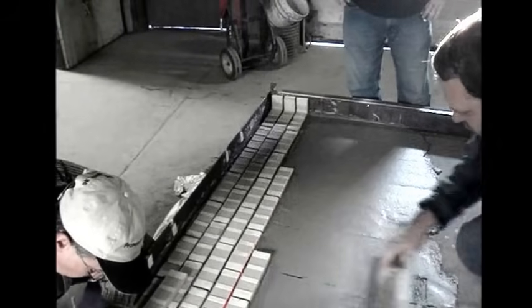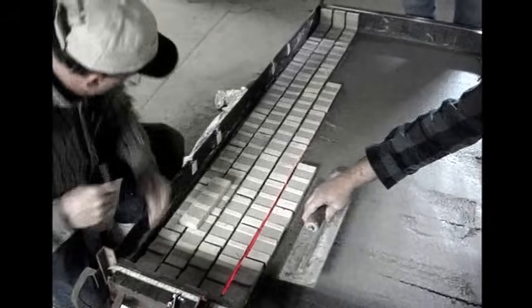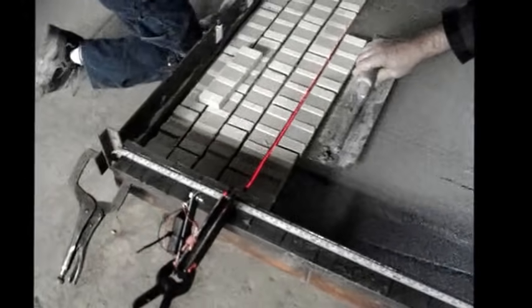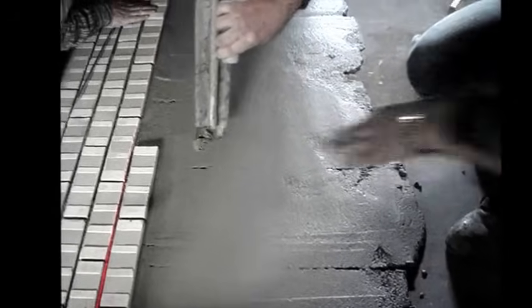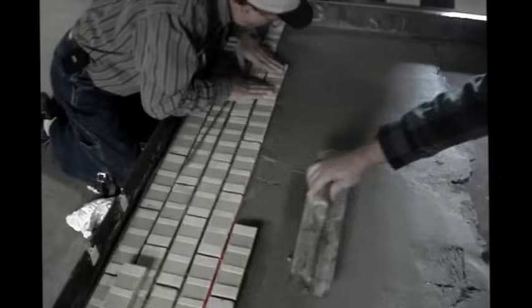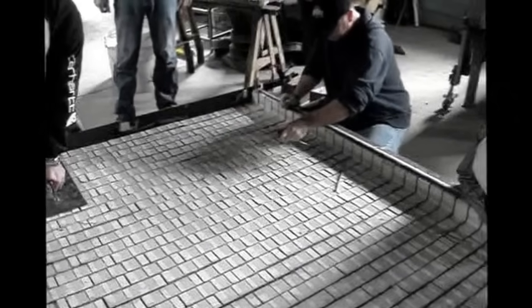Here's the beginning of laying the thin brick out. You can see the laser line is turned on, striking a straight line. Terry is working out some depths with a feeler gauge to make sure that the paper clay is at the right depth, while Tim is using some rods to draw the clay out to about a quarter-inch uniform thickness. The rods are actually embedded in the clay right now — kind of difficult to see in this shot, but you'll get to see those a little bit later.